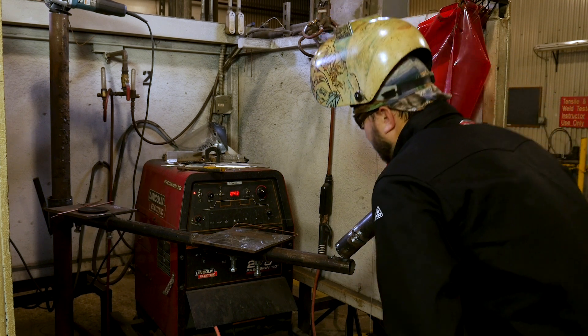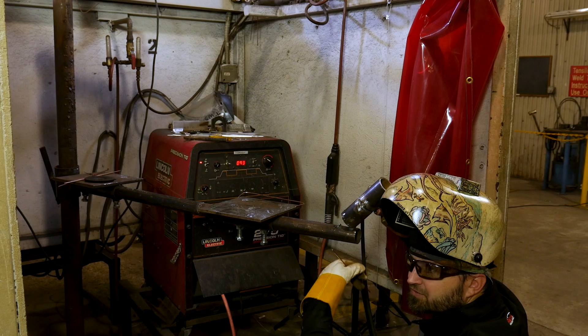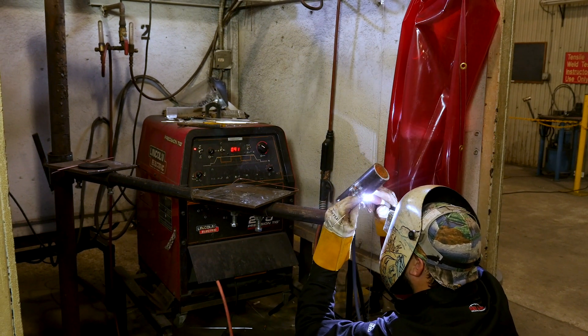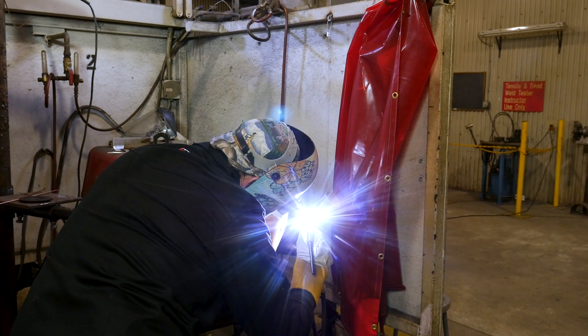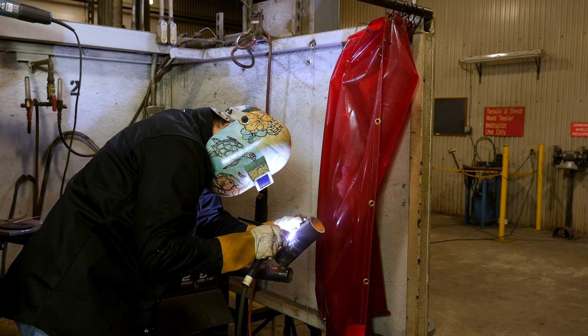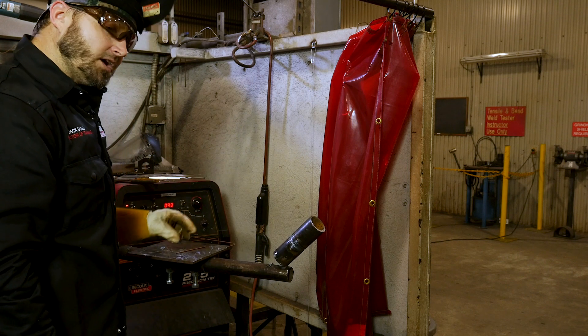So now we're going to run up the left side. I'll get down like so, make sure everything's all set up, ready to rock and roll. Like I said, it's a lot like a 2G. I've got everything in place, going to strike up here and get right into it. Stand on up and keep this baby moving. And now we've got our TIG root in there.